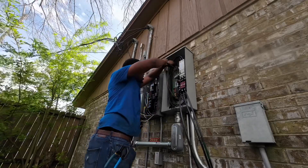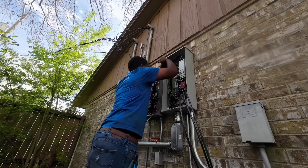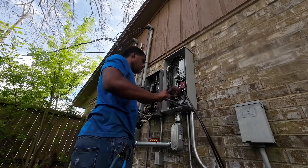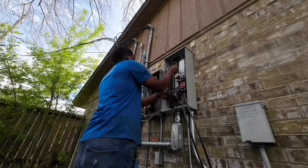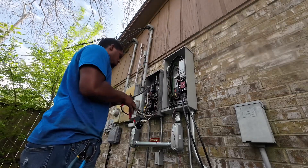Right now I'm landing my ground wire, and after I do that, we're going to be moving on to the neutral. Once we completed this job, I went back and talked to my journeyman and my master electrician, and they explained to me that whenever you are working in those transfer switches, you always want to remove your T1 fuse. That was something I didn't know at the time — just a little FYI, remove that T1 fuse.